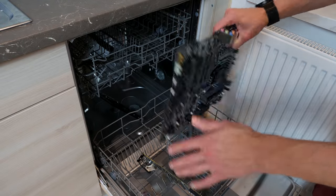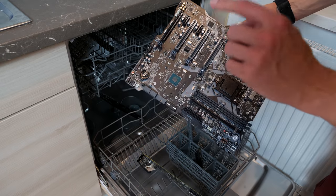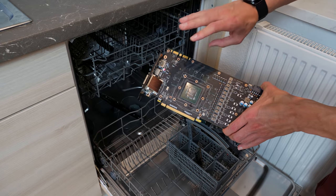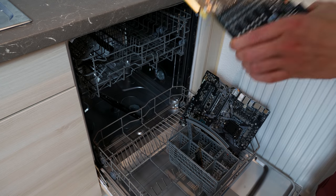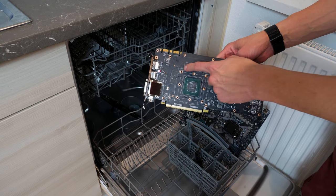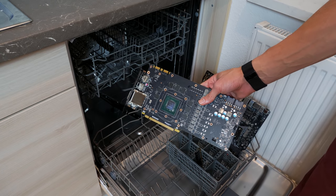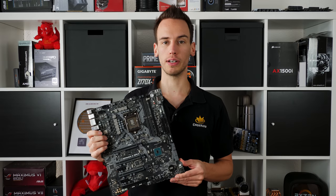I did two full runs — the mainboard, GPU, and memory stick spent almost five hours total in the dishwasher. Everything looks really nice and clean, just a little wet. The mainboard looks fine, and the VGA's VRMs are now clean with no Vaseline residues. There's still water trapped underneath the GPU and under the memory ICs, so I'll use a normal hairdryer to heat the hardware four to six times, let it cool down between rounds, then let it dry overnight.